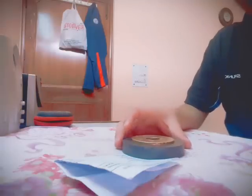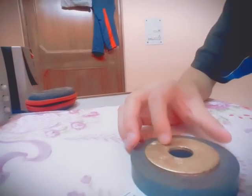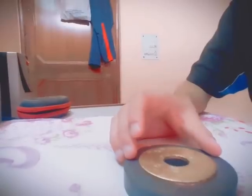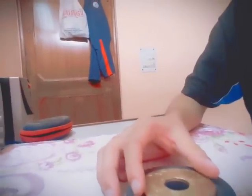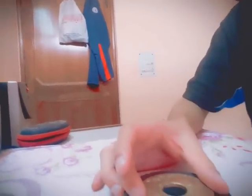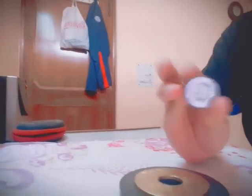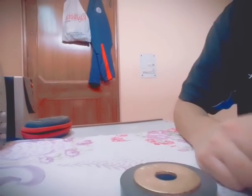This base magnet also has a soft iron core. Basically, this piece of iron is not really required if your magnet is strong, but if your magnet is weak — like in my case — this piece of iron actually focuses the magnetic flux within this region, so the magnetic power is quite strong enough to make the top levitate. I'm going to let it go now to show you how to make this thing fly.